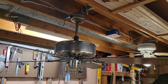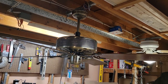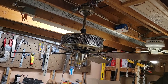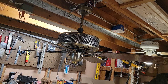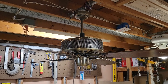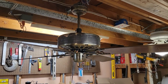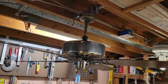This uses a 1200-watt heater at its maximum, which draws 10 amps. The ceiling fan motor draws around 1 amp, so altogether without a light this fan draws 11 amps. If you install this in a room on a standard circuit that powers lights and receptacles — as houses are typically wired — it'll definitely trip the breaker or blow fuses. So if you wanted to put one of these up, you'd want a dedicated circuit straight from the panel, 15 or 20 amp depending on whether you also install a light kit.